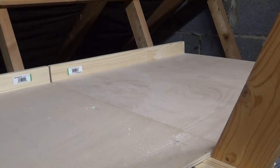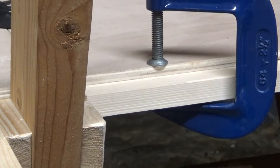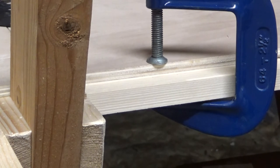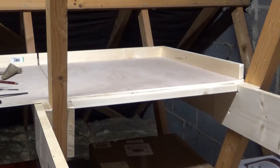That's the back piece fitted and screwed down. Now I fit the side piece which goes up against the wall. I've clamped up the side piece ready for drilling and fixing. The final bit of fitting the corner is to put a lip on it so that the centre section that crosses the loft has something to rest upon when it's put in place. That completes the corner piece.